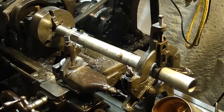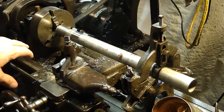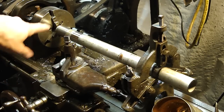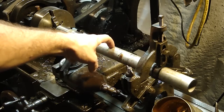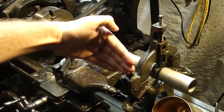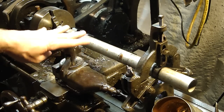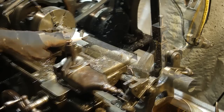I'll break this setup, flip it around, and then I'll show you how I set up my indicator on the chuck and reach out and touch on the bar out here. That's how I'm going to determine the runout on this end, because what it's going to do is act like a universal joint and bend the bar back and forth on the chuck a little bit.